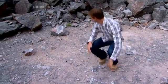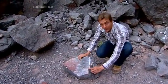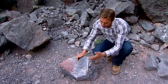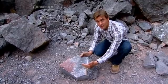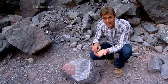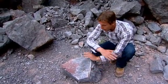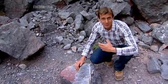Look down here — that's the hole where it was packed in, and you can see all the way down. It's just split it. This is gun cotton, and what's happened is that when the gun cotton has been compacted and confined in there, it's detonated — which is a completely different process to when we saw it being lit. This detonation sends out a sharp shockwave, and as it goes into the rock, the rock gets split. It's a much more powerful explosion.